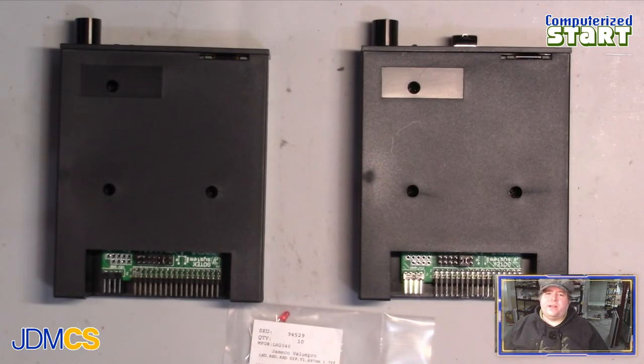The first one being Amiga ADF disk images. And that is because Amigas were ahead of their time in some ways. And in some ways, maybe they were ahead of even what was necessary. So normally on a floppy drive, you've got tracks and each track's divided into sectors and the computer writes a sector at a time. So there's a gap between each sector because you can't write a sector and not have a gap just due to the way things work.